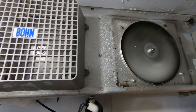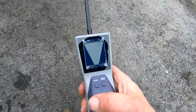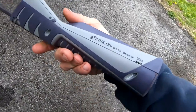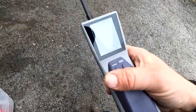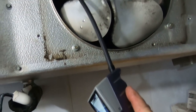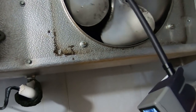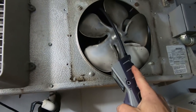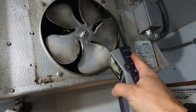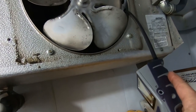One nice thing is the fans didn't come on immediately, so our delay is actually working - maybe our termination switch was working. I hate when everything's just falling apart, it makes it really difficult to try to do a good job. That one was backwards. I went ahead and calibrated out here - got it in super sniffer mode. This is the Stratus, first real life test we've got on it. Scanning around a little bit to see if we pick anything up. I'm going to recommend we insulate the refrigerant lines, replace the fan cycle control, and order a new bracket for the fan.